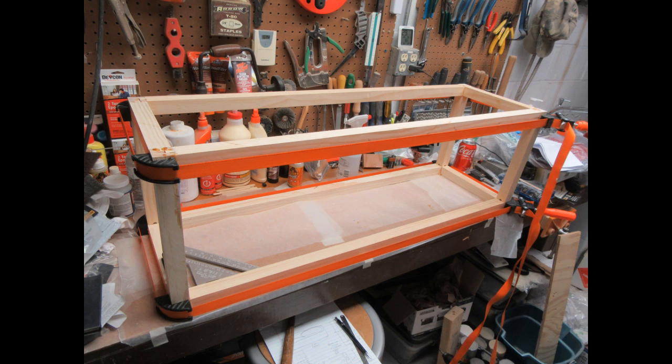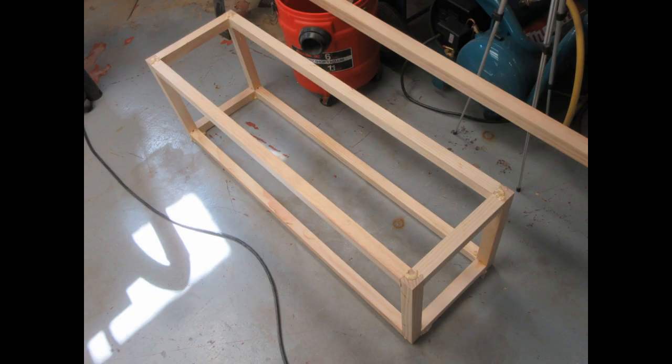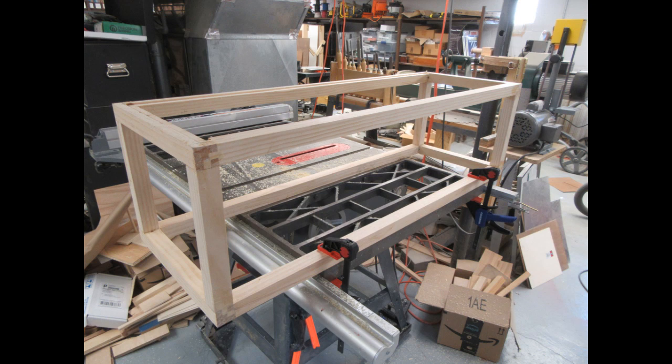I used Gorilla Glue to glue the sections together. I have to apply moisture to one surface and glue to the other in order to get the Gorilla Glue to react and foam out properly and then set. I use angles at all three axes — vertical, horizontal, and depth — to make sure everything is square in all those dimensions. Here's the frame after gluing is complete. I still have to clean up the foamed-out glue on it. I've used a chisel to clean up the foamed-out glue, and now I've got the frame clamped to the wing of my table saw so that I can route the recesses for inlaying the side panels.